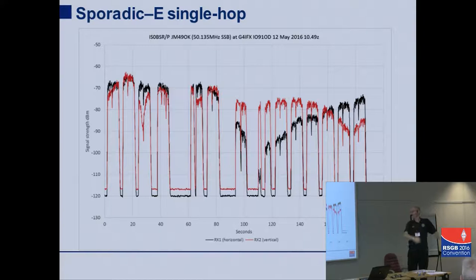It's worse than that. Sometimes it's worse than that, because your horizontal antenna will have more horizon gain in the Fresnel zone than the vertical antenna at 6 meters. Interesting question. So therefore, yes, it's worse. Well, that's a different effect though. This is noise.